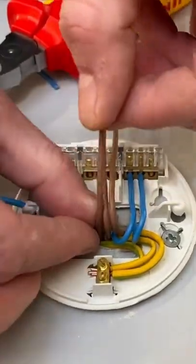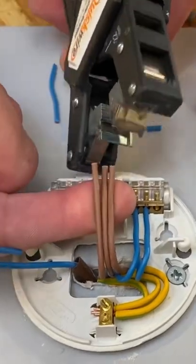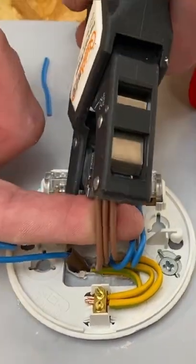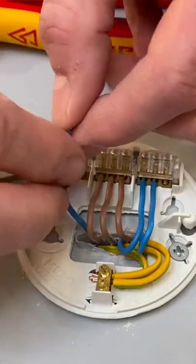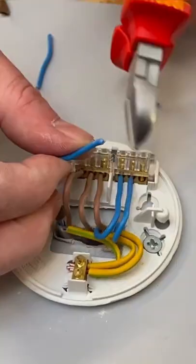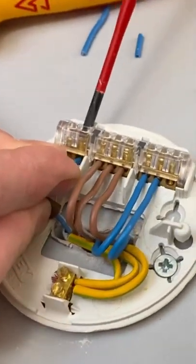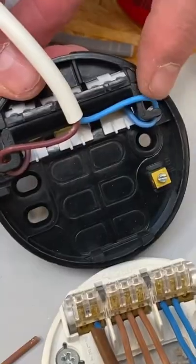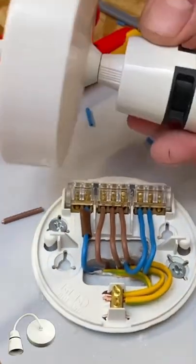Let's try and be a bit flash — let's see if we can do all three of these at once using this bit of kit here. So that's my loop section, my three lines in there going to be our switching line conductor. Maybe we can use our side cutters for a third way of doing it — strip it back, go into there, make my connection. That would be for my connections here and here for my actual pendant.